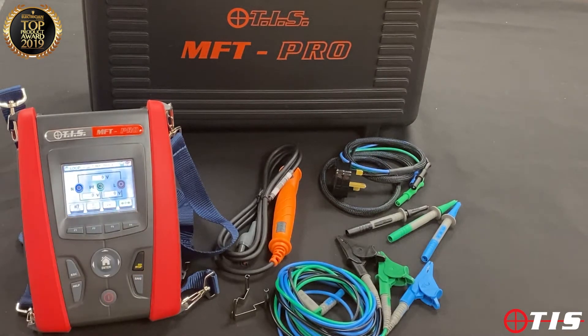Regarding loop testing, it will allow us to do single and three-phase loop testing, and importantly the no-trip loop test on RCD-protected circuits is highly accurate and highly repeatable — so even in a factory where other testers give spurious readings, this will give repeatable and accurate results. We can also dial in the fuse and breaker characteristics of the circuit, and the tester will give us a thumbs up or thumbs down as to whether the reading is correct. Should regulations change, those characteristics can easily be updated at our end, free of charge, as part of a calibration process.